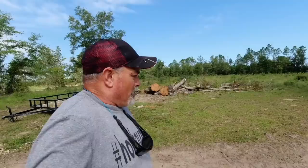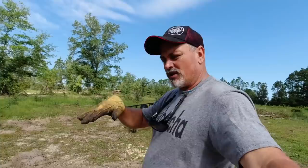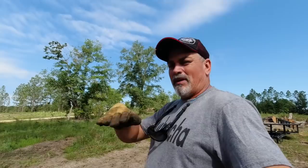And so we're going to take the 4x4s that we've got on the trailer, the pressure treated 4x4s. We're going to outline the area here, get it all nice and level, get the cardboard, and whatever the cardboard doesn't cover, I've got landscape cloth. But it's important to lay down some type of barrier, one for weed protection, and two to help prevent the rocks from going into the dirt. So let's go ahead and get started on that.